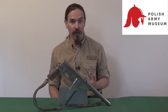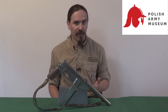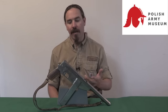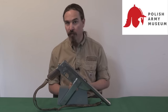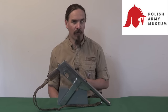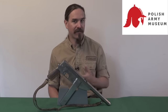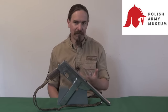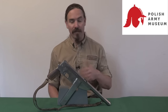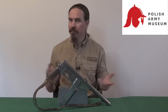Strompach started this project in 1942 and had his first prototype gun finished and working by the spring of 1943. He then enlisted the help of a draftsman friend who drew up technical drawings based on the prototype to allow manufacture of parts for additional guns, which was done by friends who worked in machine shops and could on the sly make parts for more of these Beja guns. By July of 1944 he had 11 of them manufactured, with something like 20 done total by the end of the war. The last couple were made in 7.62 Tokarev — by late in the war Strompach had access to Mosin-Nagant rifles instead of leftover WWI Mausers, and it was much easier to make barrels for 7.62 Tokarev using a Mosin-Nagant barrel already bored to the correct diameter, just needing a chamber cut.